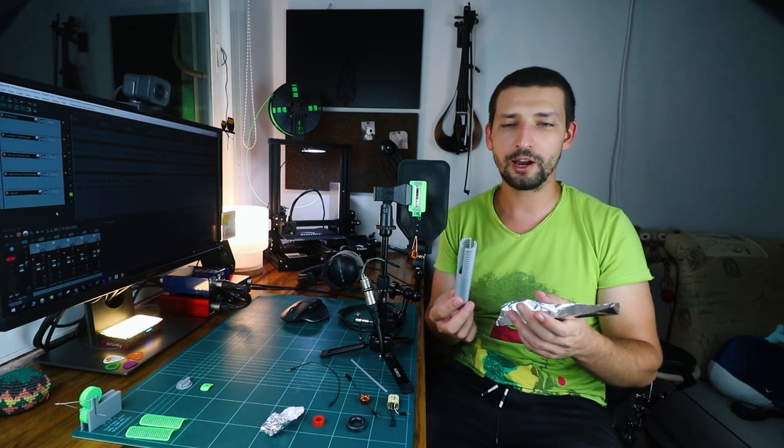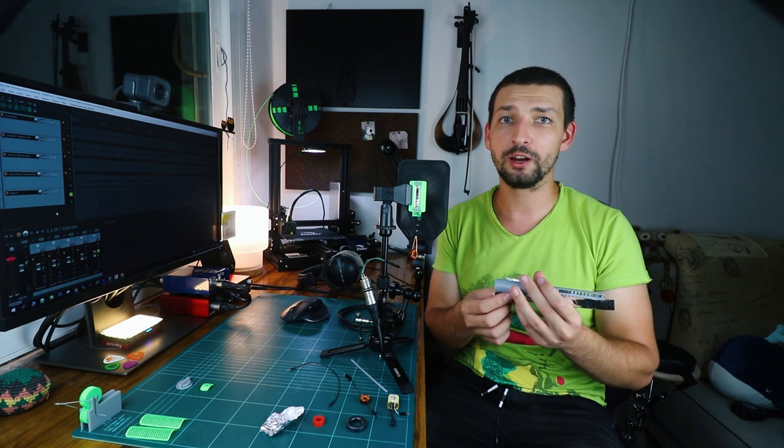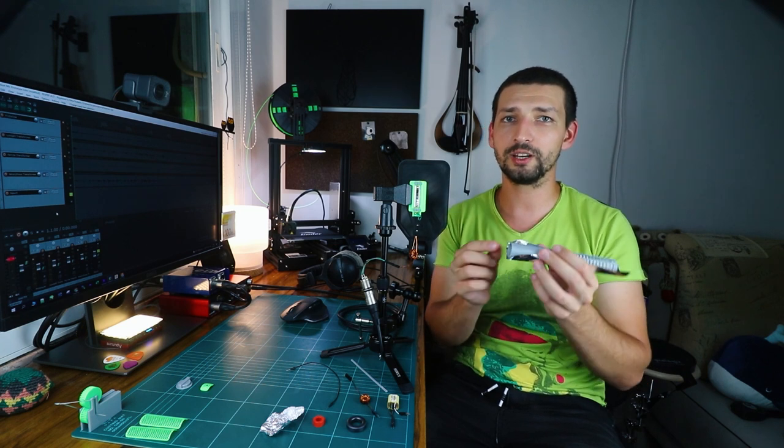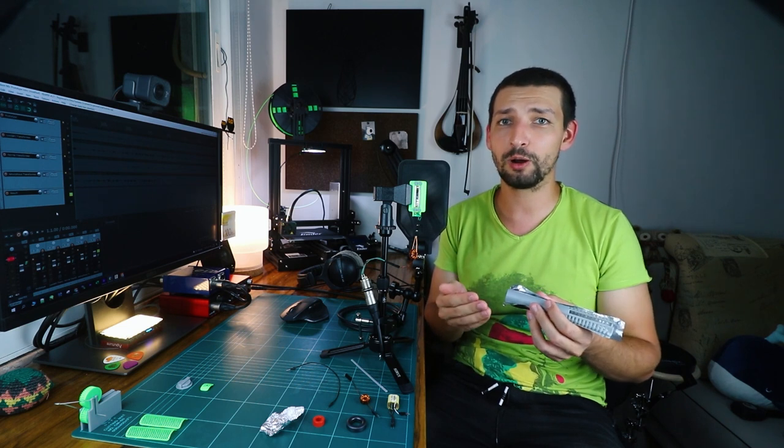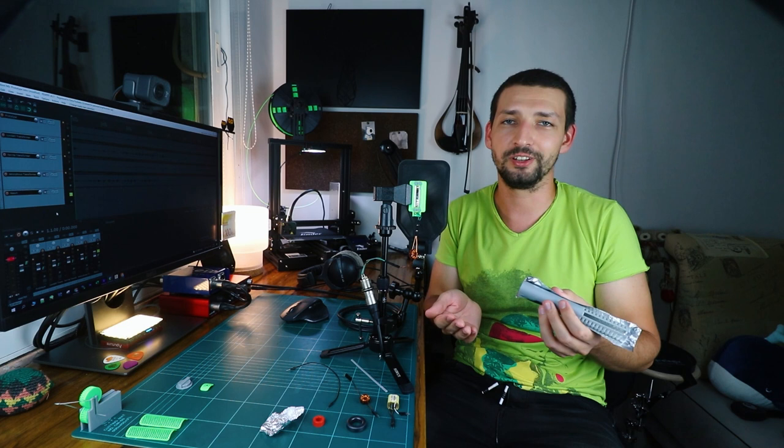As a test, you can try wrapping the whole microphone in aluminum kitchen foil while making contact with the XLR connector. If you don't hear any interference beforehand and didn't notice any change, you probably don't need to bother with any shielding. In case you do notice some extraordinary interference, try shielding and grounding the transformer first. As you have seen and heard, it pretty much should do the work.